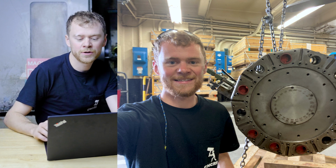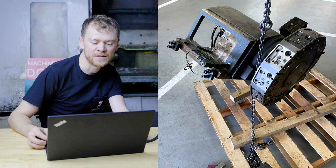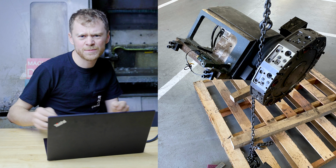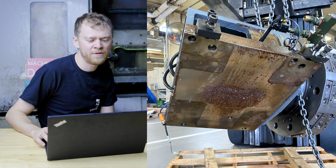Here's a picture of me, oh boy, getting ready to put the turret back on. This is a large hybrid turret. Here's a picture holding it with a chain hoist. I raised it up and cleaned the bottom of it, but it hangs nicely. It's just at the right angle, the perfect spot to the engineer's perfect placing of the eye bolt hole. So I cleaned everything out of the bottom, stoned it, got it ready to set it on there.